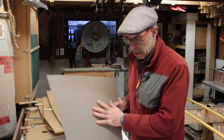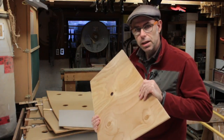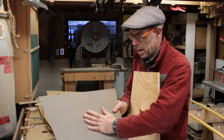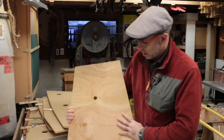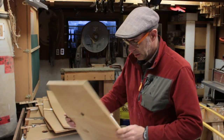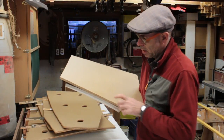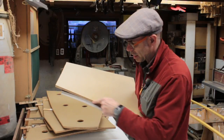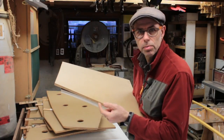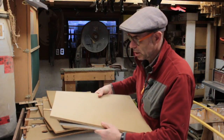Another way to do it is using epoxy, and if you use epoxy, it gives you a great opportunity to fill these voids that are a problem. You can apply thickened epoxy to one of these panels — I would suggest you put thickened epoxy onto the back of the laminate and lay that on a smooth work surface. Then on the back of the plywood you would do an unthickened coat to make sure it's getting properly saturated. You put them together, put weight on the surface, and once you've done that, there's going to be a certain amount of squeeze out. You could take that squeeze out, take a brush, and paint it up onto the edge of the plywood, thereby sealing it up as you go. If there are any little voids, you could mix up a little bit that's more thickened to work it into those voids. When you're done, you would just trim away this material and you get a nice result.